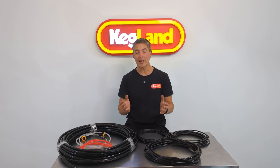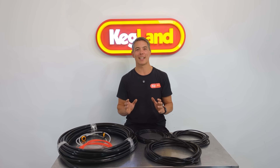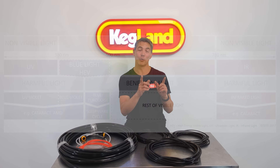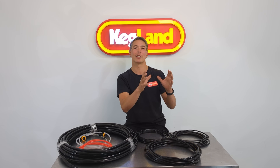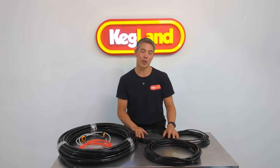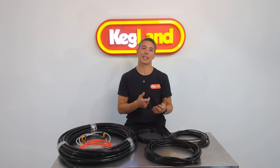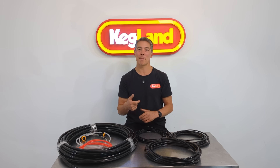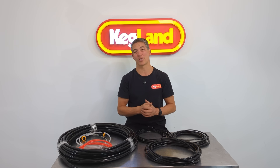It's called light-struck beer or skunking — a lot of people use that term. Although a lot of people think that the most damaging part of light is the ultraviolet, that's not quite correct. It's actually the violet or visible spectrum — just below blue light you've got violet light — and that violet range has the highest skunking potential to damage your beer. So we really felt that some type of light-blocking beer line was really important for things like jockey boxes or a tap system used outside for a party. Even with only a few minutes sitting out in the sun, that beer line exposed to violet light will become skunked really quickly, and it just smells horrendous.